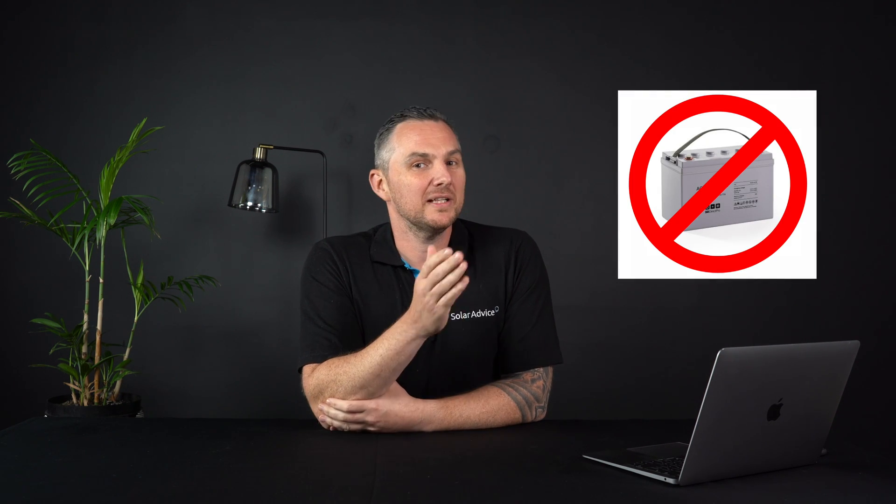In summary, the load sharing unit is a bit bigger than your typical UPS and can run a little more — things like your TV, lights, computer, phone charger, and modem — but you can't run heavy appliances like a kettle or fridge. It's suited for people who want to run a bit more than a UPS allows, but it's not ideal if you want a proper long-term solution as it's not extendable. Do not get the lead acid option — it may be budget friendly but you've got about a year or two before it gets damaged, and if you run it dry it's done.